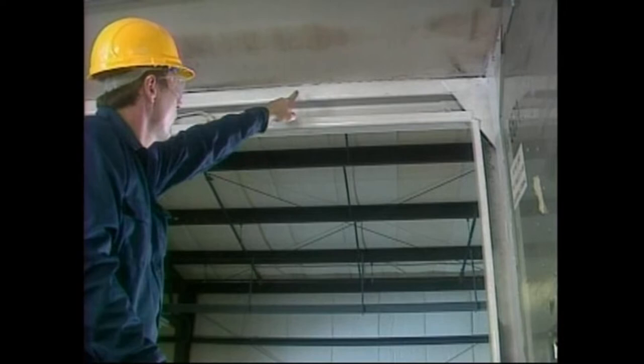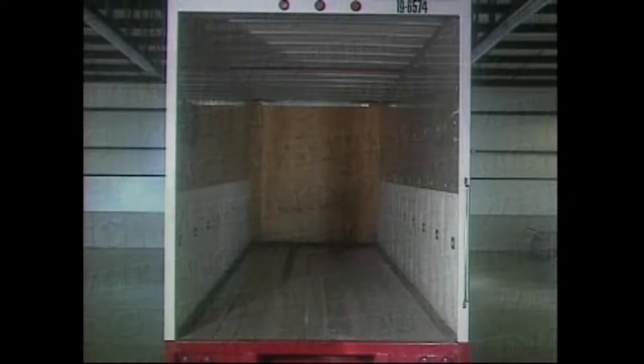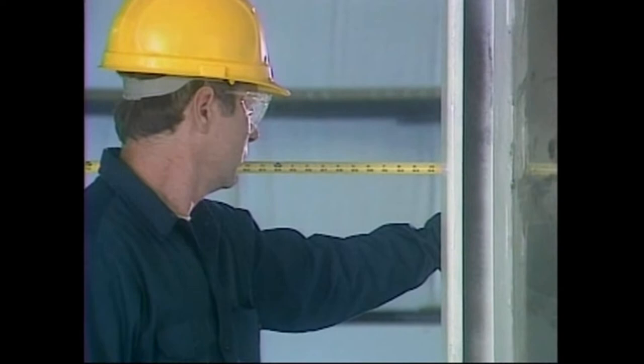The minimum post width is 2½ inches. If needed, build the posts out to at least this minimum. Next, you need to order the proper size door for the truck or trailer. This is easy to do as long as you obtain four basic dimensions. The first dimension is called the post-to-post, or opening width — this is the clear opening between the door posts.